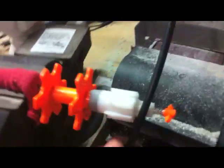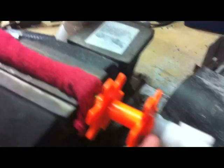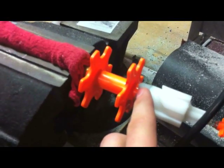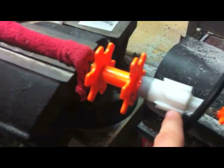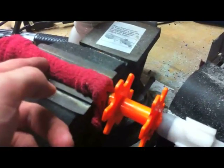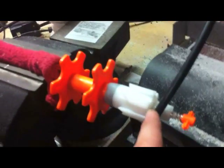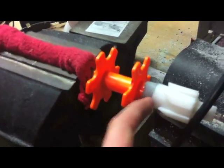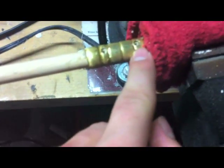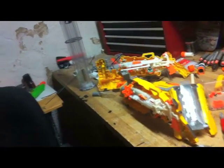I did this in two ways: I filled the back with hot glue, and I connected the front with epoxy putty. I couldn't actually get on the inside because the screw was over here and I have a piece of brass and then a dowel glued to it. So I couldn't get on the inside — I had to do it externally. But it's very secure, so I'm just having this dry now. Then I put this in the vise and drilled the other two holes to line up with the turret holes.